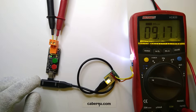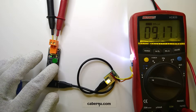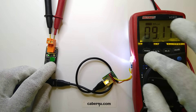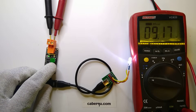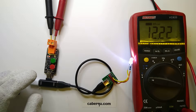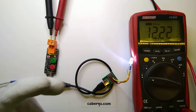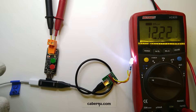At 9V, you can see the LED got a bit brighter. We're definitely running it over current but it should still work fine — it's not even getting warm. Triggering 12V, that's now over double the voltage the LED is built to work with using this current limiting resistor.